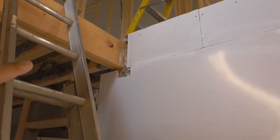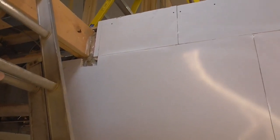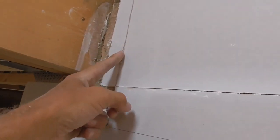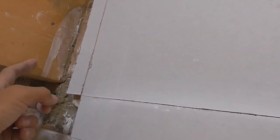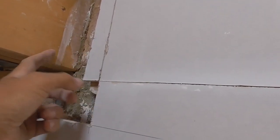As you can see, I've cut that bit of plasterboard back. I actually mistakenly marked out a full 90mm from the face of this trimmer to where I was going to cut - and obviously it's not 90mm. The new one isn't 90mm at that point because we've cut that housing out of it, so it's only 55mm.